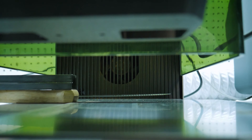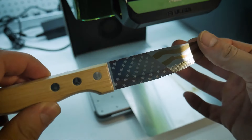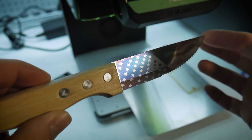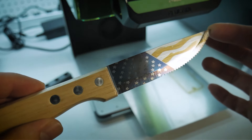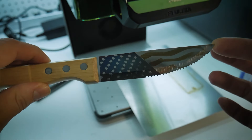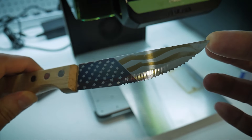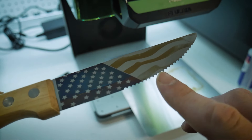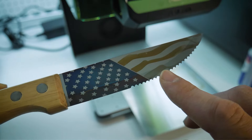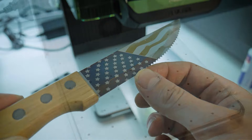The blue laser generates a lot more heat on the steel, so be careful about warping the blade — and also be careful when picking up the workpiece after engraving, as you could burn yourself. The final result was honestly a lot better than I thought it would be. The only area where color started to shift was at the edge of the blade where it begins to taper downward, which is expected as the surface falls away from the laser and goes out of focus.